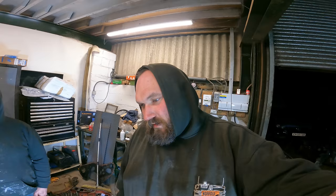Originally, when we planned the project, the engine was coming out for a spruce up with a paint and a top and tail on the service. By top and tail, I mean rocker covers off, sump off and inspection. Make sure she's in good health. Didn't plan or expect to have to strip the engine out, let alone it being cracked. The crank's heavily scored.